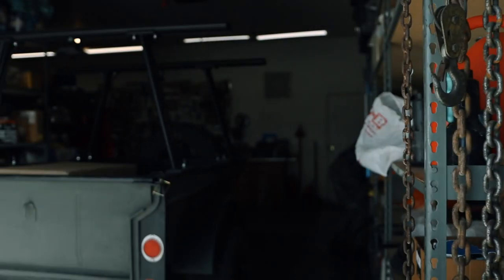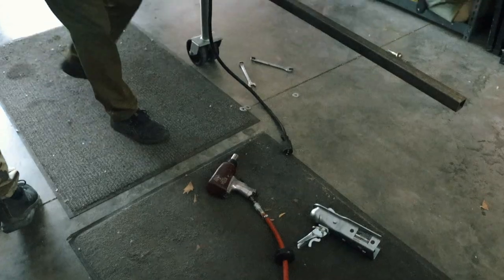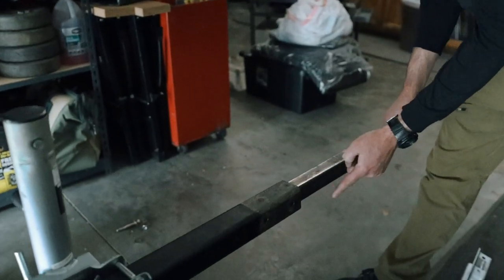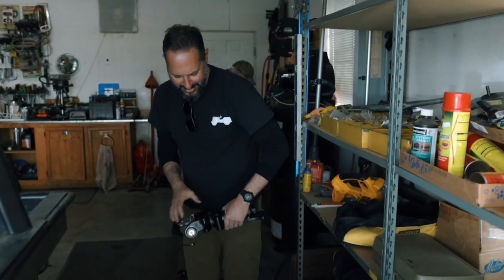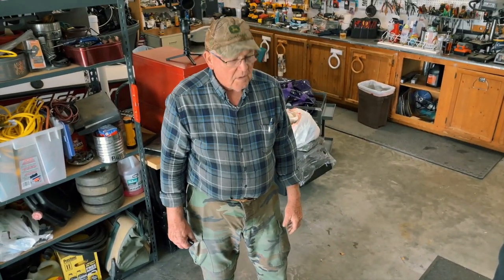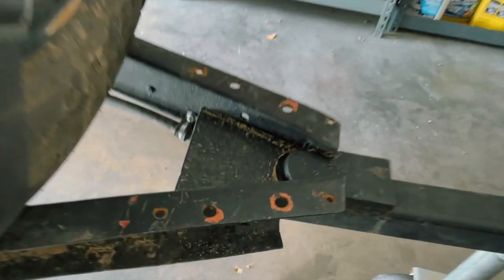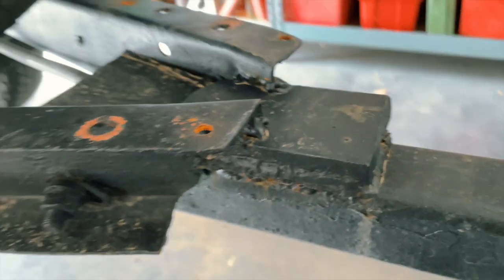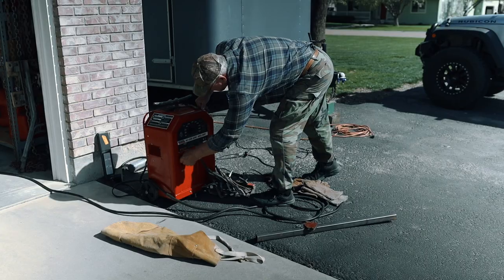With our plan in place we got started. First we stripped off the old hitch to see how we could get the smaller square tube inside and attach it. It fit inside decently well but we had to figure out how to stabilize it so it was centered and tight. So we decided to weld washers as spacers all the way around — two here and two back here to eliminate the slop. It's precision work — look at all these precision details.